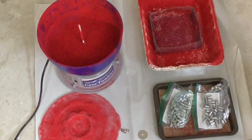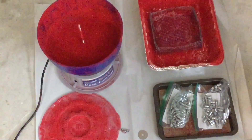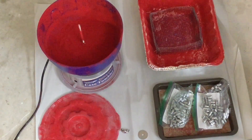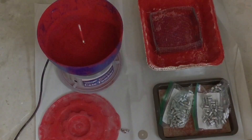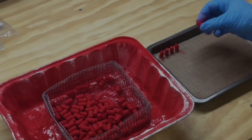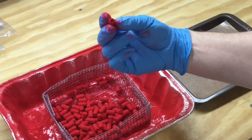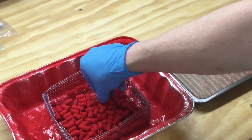This mirror red goes on as easy as the Ford light blue. Just a little bit — a minute or two of shaking in a plastic container will apply it just fine. But since I'm doing 30 batches of 60 bullets, that equates to 1,800 bullets I'm going to powder coat. For the hollow points, I will tap them on their nose a little bit, just to make sure there's no powder buildup in the nose or in the cavity.